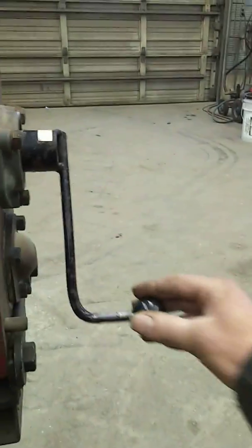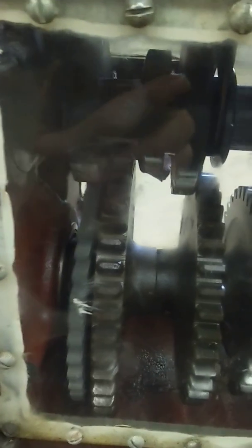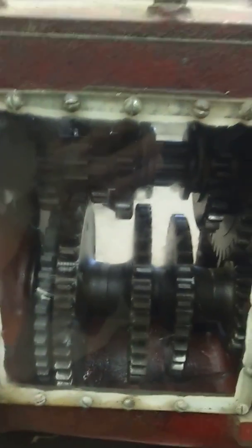We'll look inside. Turn the crank. There's the aluminum gear that all it does is splash oil around inside. So when it's running on stationary PTO work, there's still oil splashing around into the bearings. The very early Farmall A's and B's did not have that, so they were lacking a little bit of oil in the top shaft.